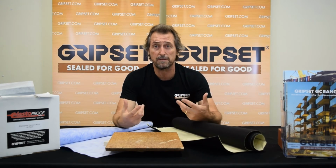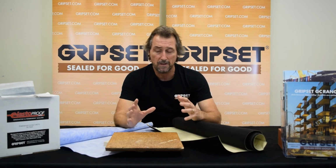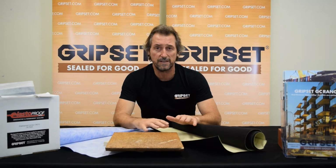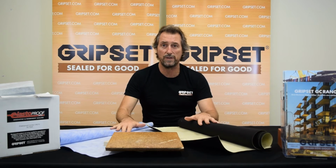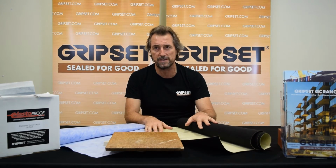And as I said, there's the atmospheric moisture that the timber will absorb from underneath in the eaves and the cavity. So I don't believe anyone should be waterproofing over timber externally. Protect that substrate, as I said earlier, with a system like a cement sheet underlay first, and then waterproof it correctly with one of our systems.